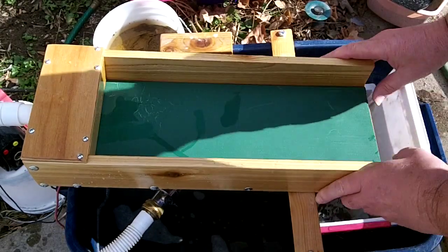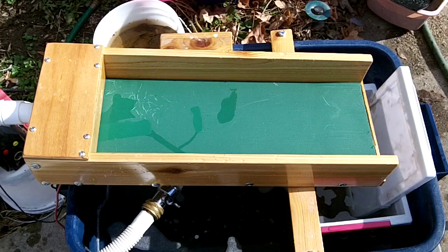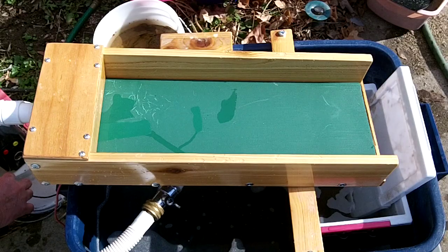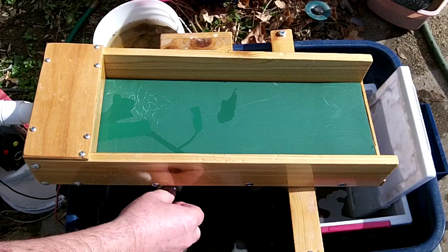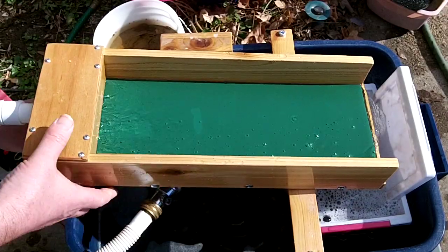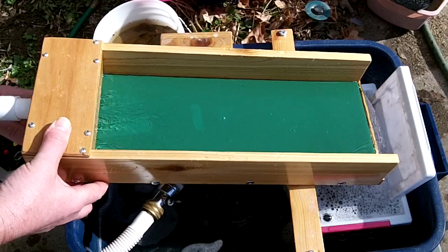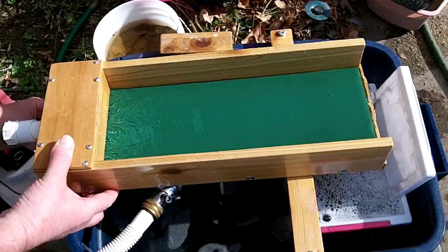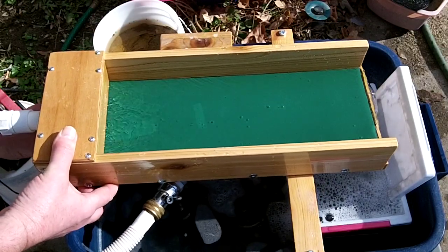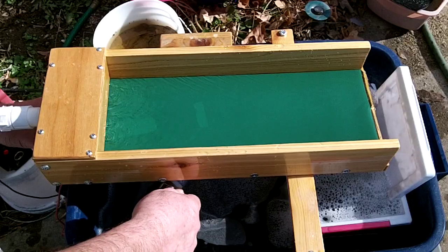To run the cons from the mat, we can put the little miller table insert in there and give it a try. We'll have to drop the elevation back down to where the table is almost level. The miller table — you start out at almost flat, maybe 1 or 2 degrees, and then change the elevation and the water level as needed to separate the fine gold.